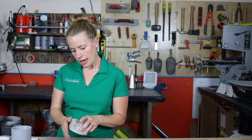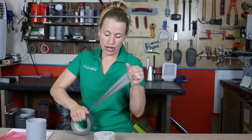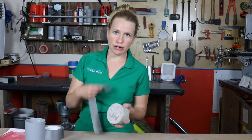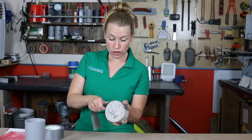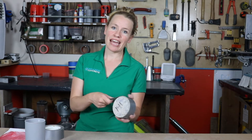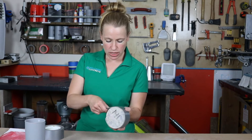You're going to take your sample and make sure that the side that was cut is the side that's going to be going down into the water. You have to fill up pretty much all the surfaces except the area that's going to be sitting in the water, because we don't want any extra absorption hitting anywhere else — we're trying to get a true idea of the surface area versus what is being absorbed. You're going to take some tape; I'm using duct tape right now, usually we use gorilla tape. You're just not going to get any water seeping up through there, so get some really good tape and get those sides covered.